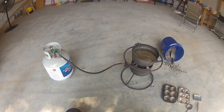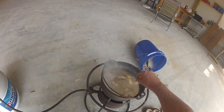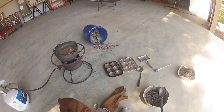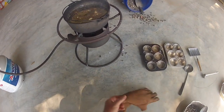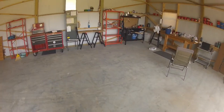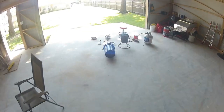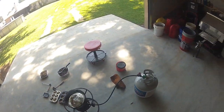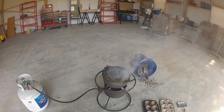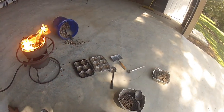I'll just put a little bit of sawdust in there — just a little sprinkle — and maybe a little wax, let that carbonize again. One last stir-up and we'll be ready to start making ingots. That's the fun stuff to me. I'm trying not to make these little episodes go too long, but I want to let you see it. I'll burn that stuff off, stir it, and then I'll show you making a few ingots.